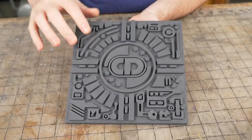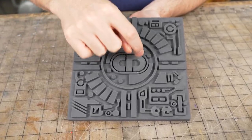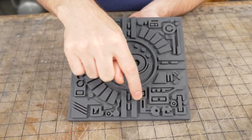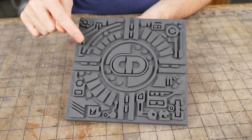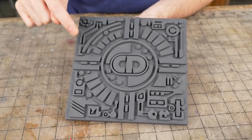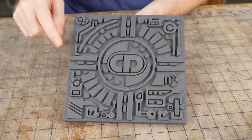I need to do a couple of things before I can lay some hot plastic down on this, including a little bit of sanding, maybe a little bit of filling, and I want to drill some holes through this because there are some small details and little cavities that probably won't get any air pulling the plastic down into them. So I'm gonna add some holes. Now could I have added those to the model before I 3D printed them? Yes. Why didn't I do that? I just thought of it right now. So I'm gonna have to manually drill some holes.